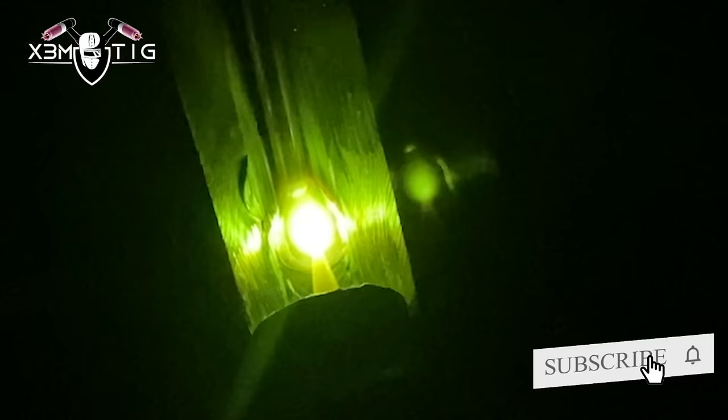Continuing on — preheat, keep that wire inside, keep that constant connection and constant feed. Feed enough to get a nice solid buildup, good knife-edge root protrusion inside. When you go up to a tack, I like to slow down — I want to see both edges before the tack. Pause on the sides, go a little bit faster over the middle, and then at the end just try to make a nice solid connection. There's the root section so far — taking a shot from the outside of the gap.